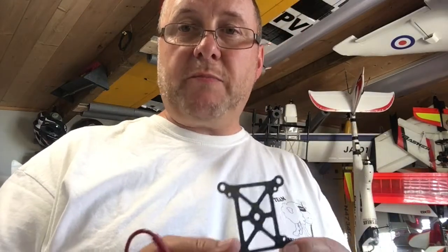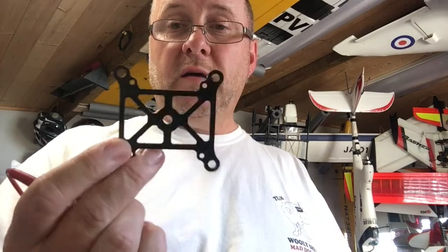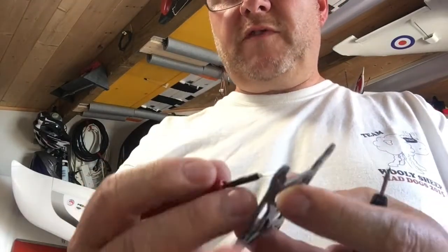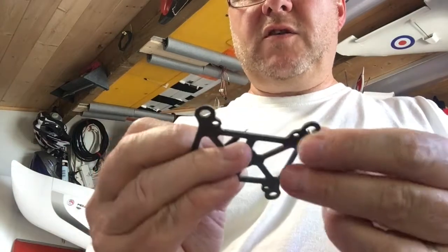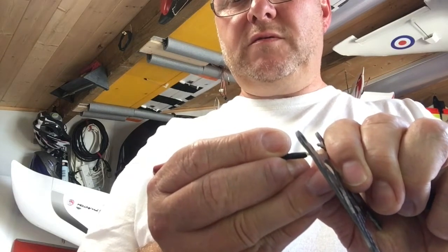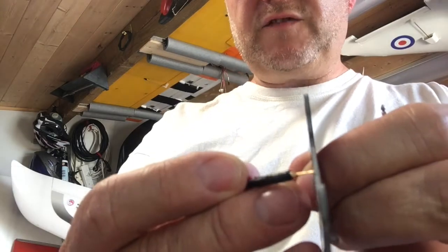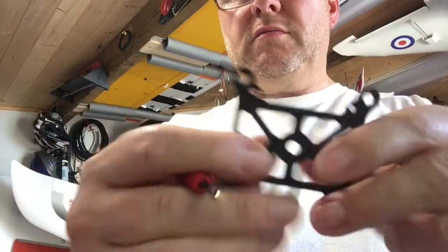Now what often happens, you get products, which is cheap Chinese crap, like this. It looks like carbon fiber, smells like carbon fiber, tastes like carbon fiber, and there is carbon fiber in it. However, it's a glass fiber sandwich. There's carbon fiber on the top edge, but if I touch the other side, nothing. As I move to the outer edge, I get it. So that is what's called a sandwich. There's glass fibre in the centre and carbon fibre skin on the very outer edge. Very thin, very strong, but there's a risk of it delaminating.